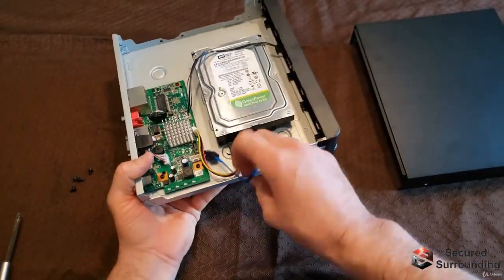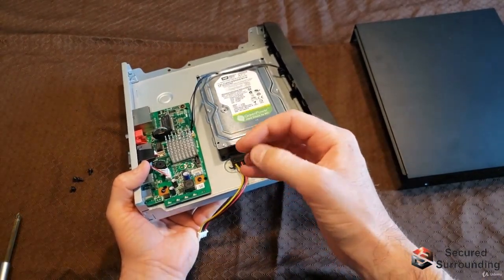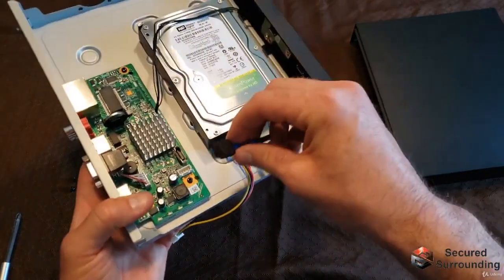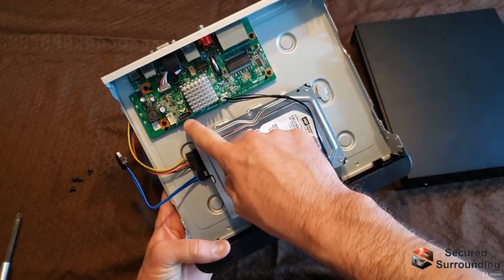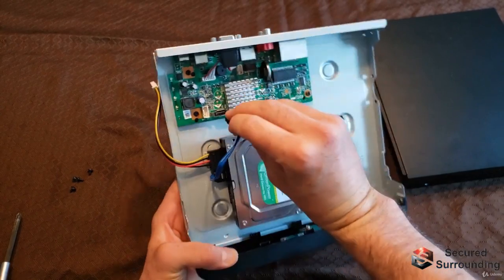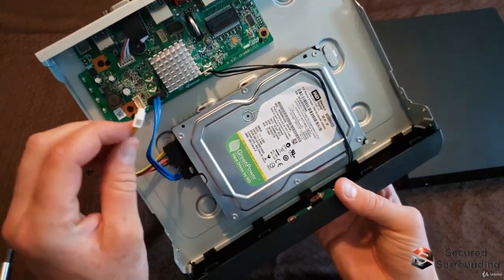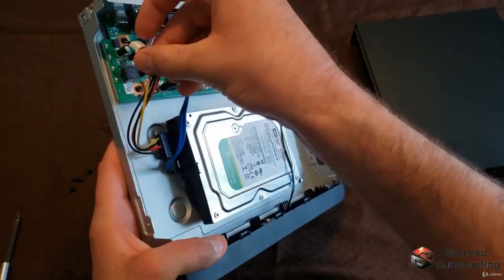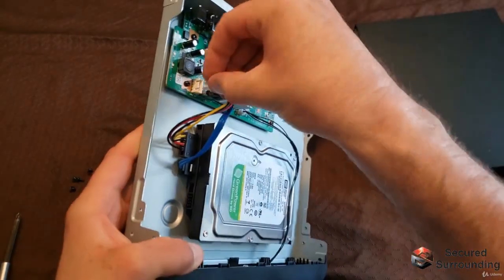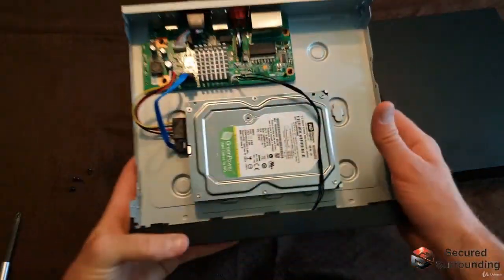And then these 2 cables. This blue one is the exact same on both ends. It looks like a little L, so just pay attention to where the back of that little L is, and then that seats in. If you see this guy here, there's a little L on the back of that, so you just copy where that's going, and then that'll seat in like that. And then this guy, there's only one spot for that to go, and that is right here. There's 2 little pieces of plastic that come up there, so those sit in right where they should. So that is basically it.